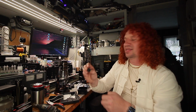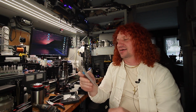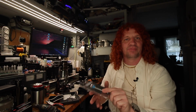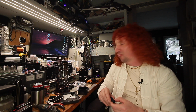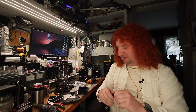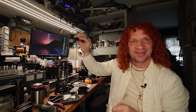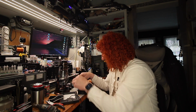So these little guys, these are a 16 millimeter hole for the bulkhead part of the connection here, and it's got its own little washer. So since I don't have a 16 millimeter drill bit, I got a 16 millimeter Forstner bit. So this will drill a very nice, clean, and square hole for whatever, plastic, wood, that's what it's designed for. And then we'll jam our wires through after we're done, from our solar panel here to, of course, we'll have to make a connection for the lamps here. So what we'll be doing is stealing the wire out of this so I can use this little weather pack connector. So we'll throw all them little bits back in.